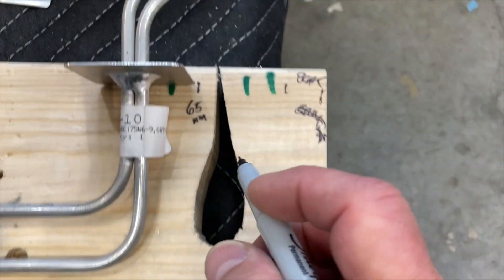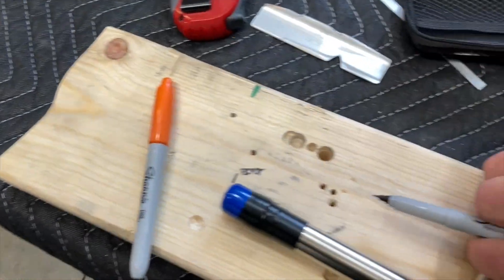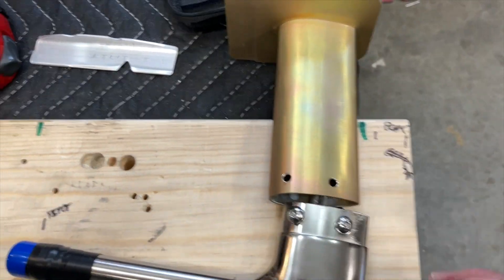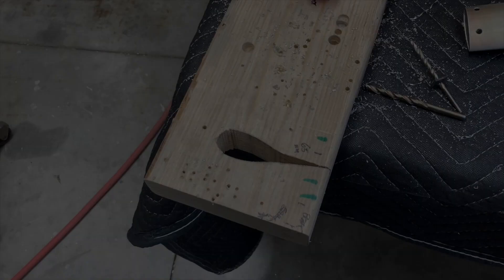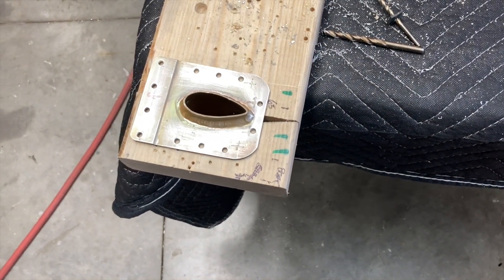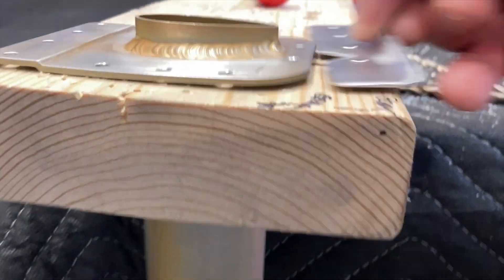This is the back touching the spar with 15 millimeters minused off, making it 65 millimeters. That's where the back is supposed to be, and the front of the pitots are right here. I'm lining up the new pitots right here to come up with the exact distance to the center spar. You could cut yourself a little jig — it helps. These things are so awkward for measuring, drilling holes, and figuring out how thick a wedge you have to make because the back turns up quite a ways.